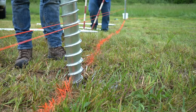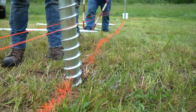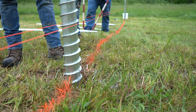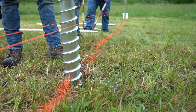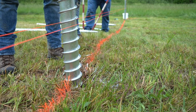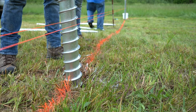To prevent heaving due to frost, ground screws are designed to have at least two-thirds of their thread length installed below the local frost level. Frost level is the primary factor in determining the length of the ground screw to be used. ICC compliant ground screws must be installed to a minimum depth of 4 feet 11 inches to achieve the load capacities found in the ESR load data.